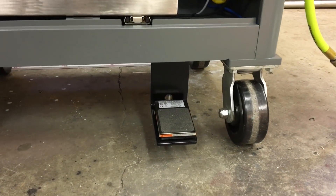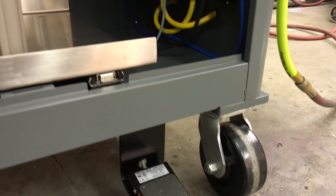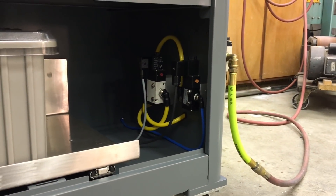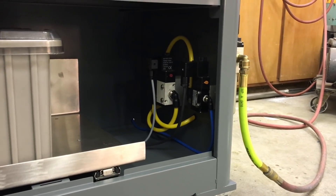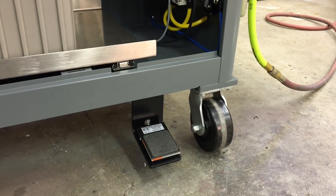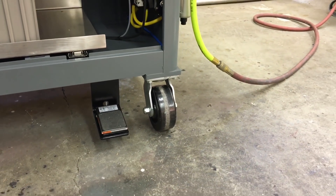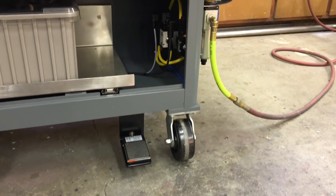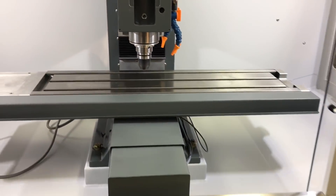We're down here at the front of the machine. That is what activates the drawbar — through a couple of solenoids, and there's also an interlock associated with the VFD, so you can't make the mistake of hitting the go pedal when the other thing's going.